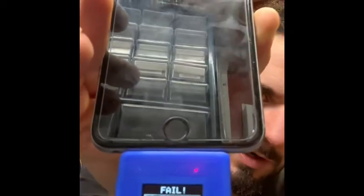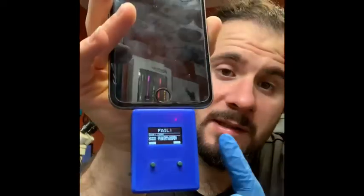You see guys, fail, check TriStar, Hydra. So so far the device is telling me the phone has a TriStar problem, so that's why it's not charging. But first, like I told you, I'm gonna check another charging port and make sure. Okay, so thanks for watching this video to check if the phone has a problem with the TriStar or something else. And after the repair, I'm gonna show you another video, guys, what I did to fix it. iPhone 6 Plus is not charging due to this cable short.